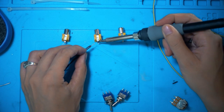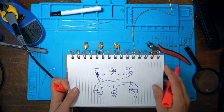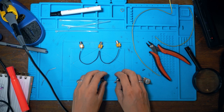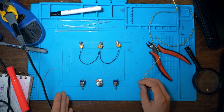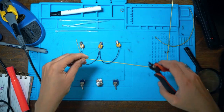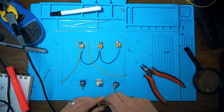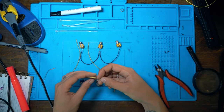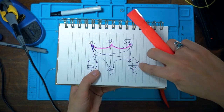You want to warm the part first and then put your solder. So we've hooked up the ground on both connectors — that's what we've done. Good job. Now we have the two switches and the 1k pot. For the colors I'm going to do one color per side so it's easier to see what we're doing — a short one going toward one side and a longer one going to the other. There's also one that goes from the middle to the other side. You want three cables per side.